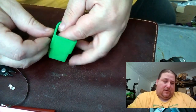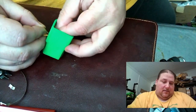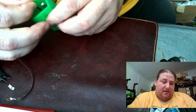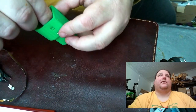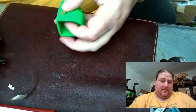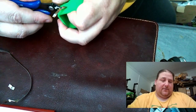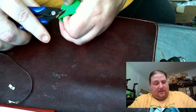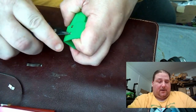Now we're sticking out the side here, and we just feed this through this hole. Grab it — it helps if you can roll it in, because the metal wants to form to a shape. We've got to go out one more time right there — you'll see it pop out of that little slot. Grab it gently and give it a little tug, then fold that down into a nice crease. Snip off this little bit right here — there we go. Form it into that hole right there. No screws, no adhesive, no nothing.